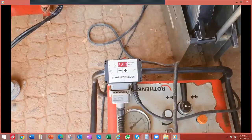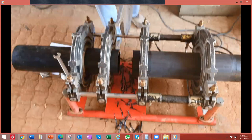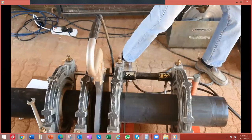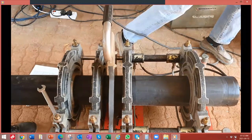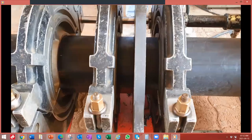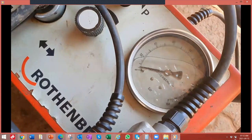The temperature is now 220 degrees and we are ready to weld. The heating element is inserted between the two pipes. The hydraulic unit then pushes the two pipes together. When this process happens, it is important to measure the drag pressure — when you have a long length of pipe, it takes a certain amount of energy to get that pipe moving. The next process is to watch the bead cleanly form, and we require a height of 2.2 millimeters. There is hardly any pressure on the hydraulic unit at the moment.